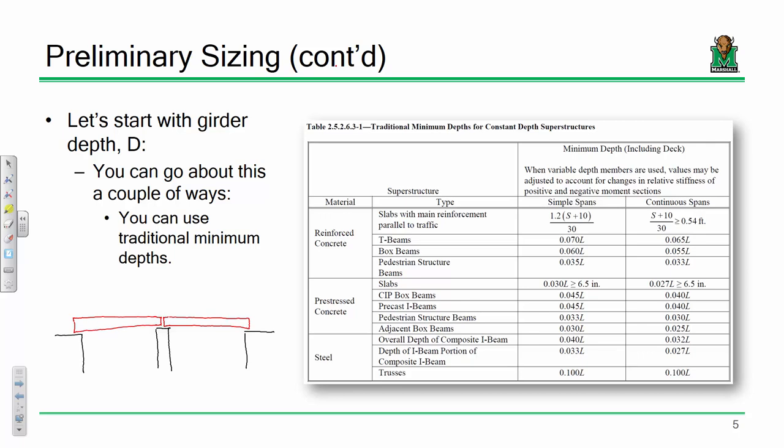Here's a for instance. Typically the maximum width of an element that you can ship is 7.5 feet. If you've got some element on the flatbed that's wider than 7.5 feet, you would need special permitting. I'm trying to make y'all avoid that. But that shouldn't be a big deal. I'm going to make you do some digging on that, a little bit. Everybody okay with this so far? All right.